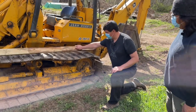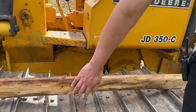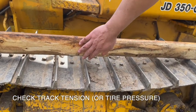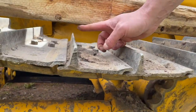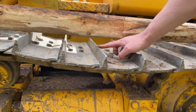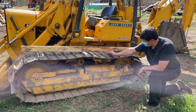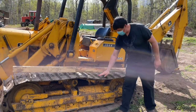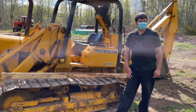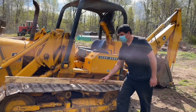What I'm going to do here — you want to use a straight board and you want to see what your distance is between this edge and the lowest part of your track sag here. You don't want this more than a couple inches and you don't want it less than three quarters of an inch, so you want it somewhere in between there. Once you've operated this particular machine, you'll get a pretty good feel for it, kind of like when you run a chainsaw and you're checking your chain tension — it's the same thing here.